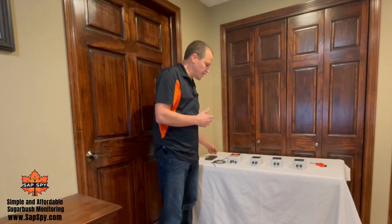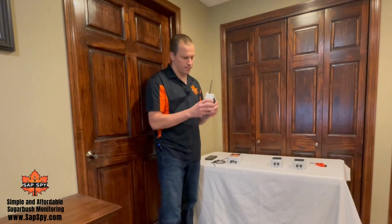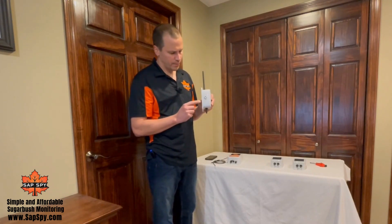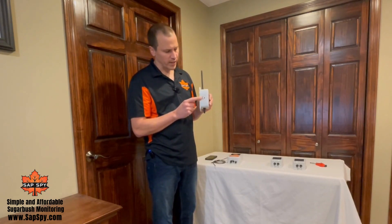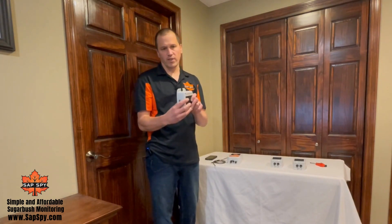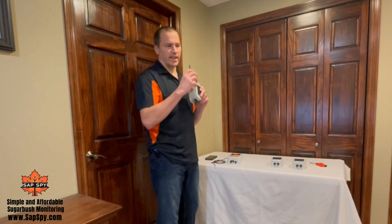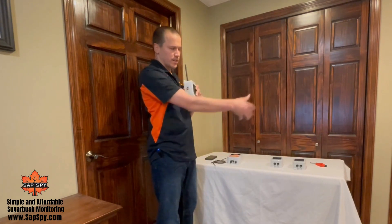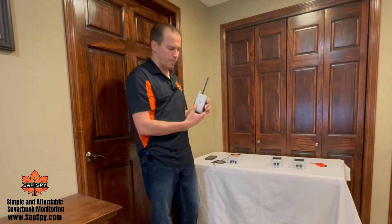At this point we can turn on the node and the hub will respond. Click the on button. The light will blink once and then blink two additional times. That first blink is it making a join request to the hub, and then receiving the configuration. The next double blink is when it takes sensor readings, sends the readings to the hub, and receives a response. That's how you know it's communicating properly.